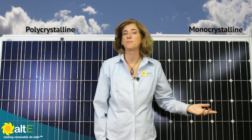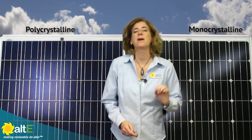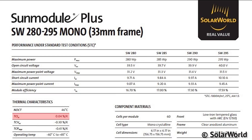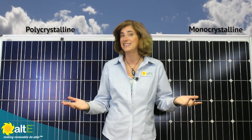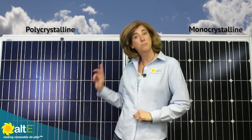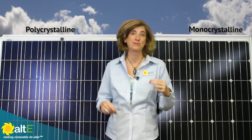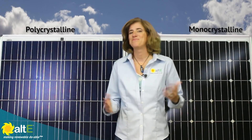One performance difference is how they react to temperature. Monocrystalline panels handle the heat slightly better than polycrystalline. Comparing the temperature coefficient of the two types shows that monocrystalline short circuit current drops 0.04% for every degree Kelvin over standard test conditions of 25 degrees Celsius, or 77 degrees Fahrenheit. So if it's 20 degrees hotter on the roof than in the test suite, which is highly likely in the summer, the monocrystalline solar panel can lose 0.06 amps out of a rated 8 amps. For polycrystalline, it loses 0.051%, which equals losing 0.08 amps. So the difference is 2 one-hundredths of an amp. In extreme desert conditions the difference may be big enough to matter, but for most residential environments the difference is quite small.